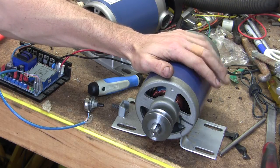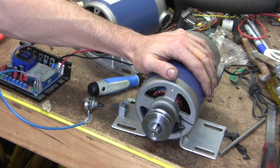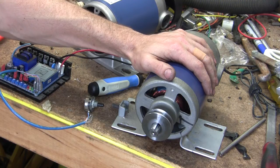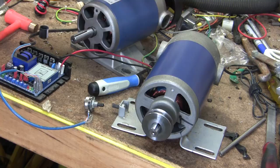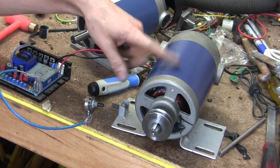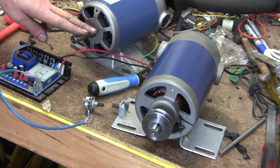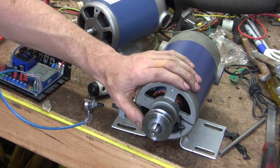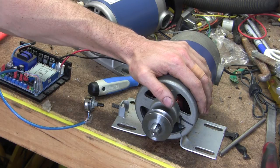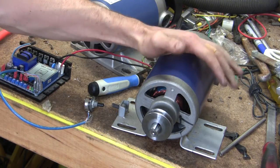The only thing is I'm guessing as to its RPM. But being a DC motor, as long as it's not getting too hot and the brushes aren't arcing, it should be fine. Just looking at the wire in this, it should be able to handle a lot more current than the other motor, and that one is one and a half horsepower. So I'm going to say this is probably a two or two and a half horsepower motor. The one in the back runs at 4700 RPM, 6 amp, 180 volt. So I'll probably run this one at about 8 amp, 180 volt, and about 4,500 RPM.